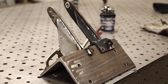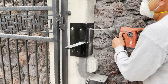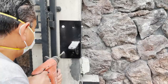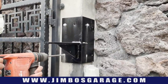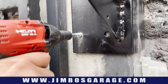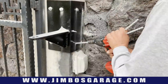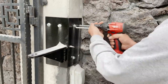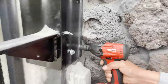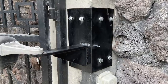We're installing this thing now with a rotary hammer. I'm using some 3-1/2-inch screw anchors from Hilti — these things are amazing when attaching to concrete. You just drill it out, drive these things in, and this bracket will never come off the wall. It is a solid, strong connection, and with eight of those in there, the bracket's never going to go anywhere. There it is all hooked up. Everything seems to be working good, and it's a big improvement from what they had before. This was a fun little project — I love doing these. Hope you guys enjoyed this video. Thanks for watching. We'll see you next week on Jimbo's Garage.